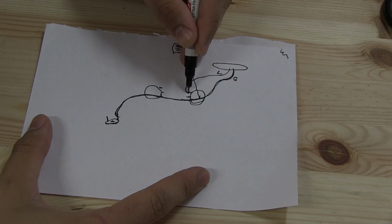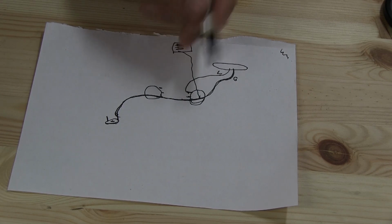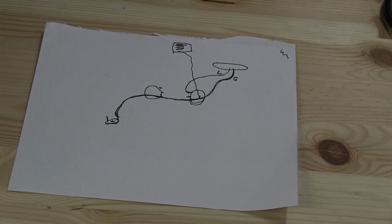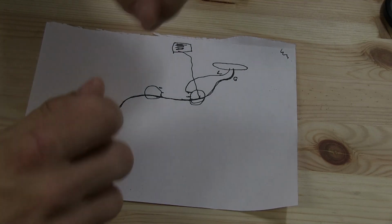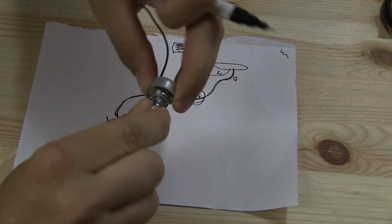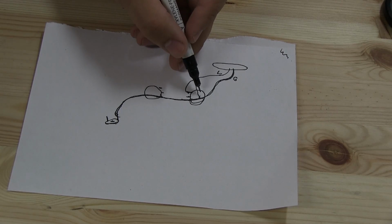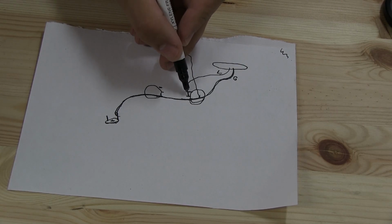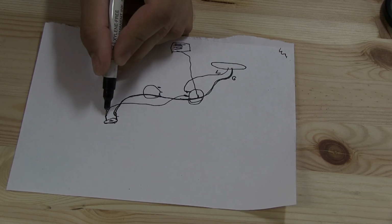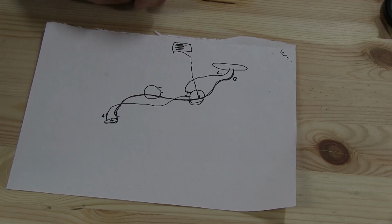And that goes there. Because this is basically a resistor, but a resistor that doesn't have a set value, but one that you can change by moving the knob. So you're just pulling that wire through the entire pot by soldering to it, and then the connection comes out on this side and it goes to the output jack, to the lead of the output jack.